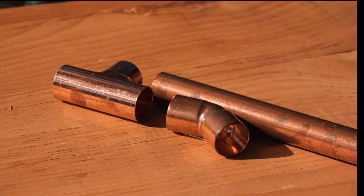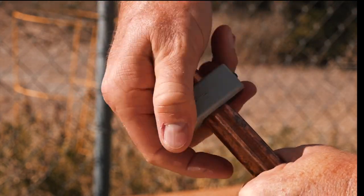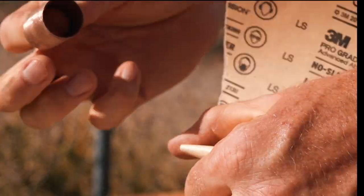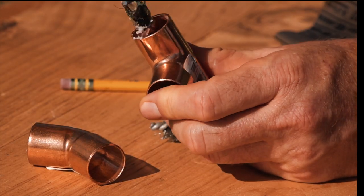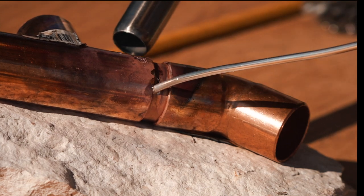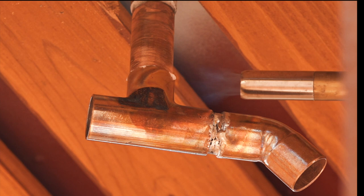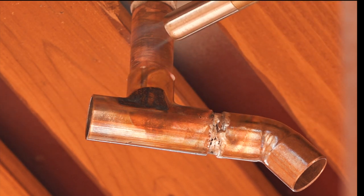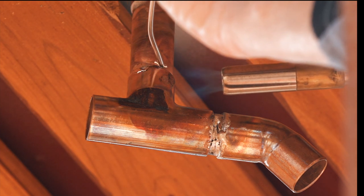Now for the plumbing. Water needs to go in and come out. I could have used PVC instead of copper, which would have been way cheaper, but I think copper fits the overall theme better, and after all, it's not that much pipe. I'm putting in a T at the bottom. One side goes to the outlet, to the drip irrigation system, and the other side goes up and to the side of the barrel, where I will attach a clear pipe as a water gauge.